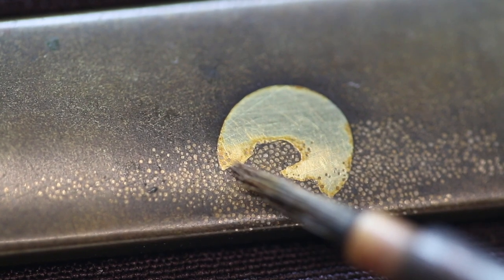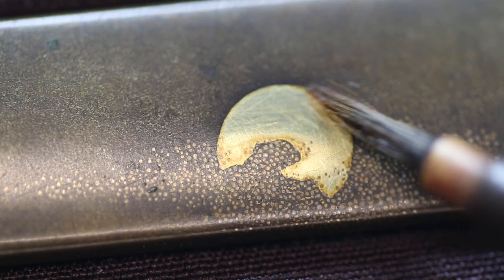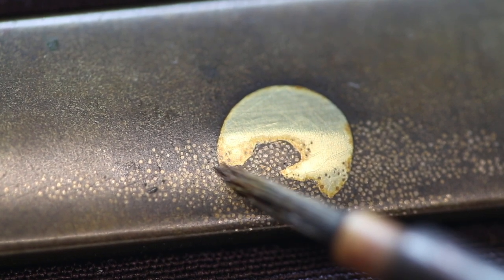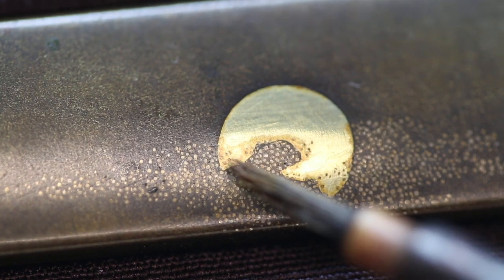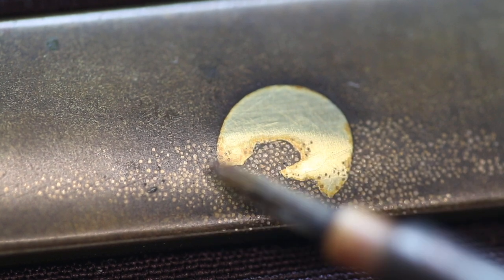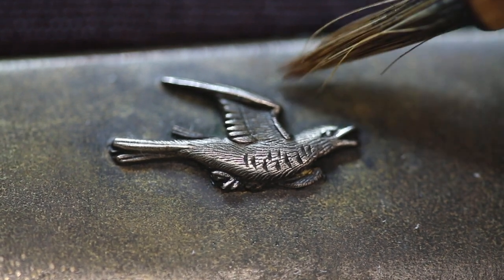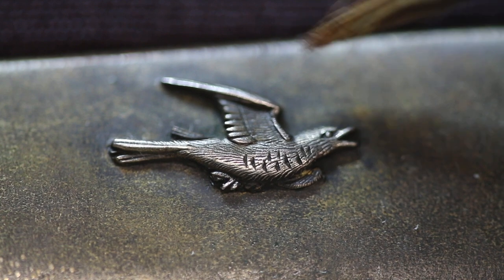There's a little brown staining on the gold. What that most likely is is the silver component of the alloy — it being gold and silver — tarnishing, forming a silver sulphide or a silver chloride, or a mixture of the pair. That then, with the colour of gold and those wavelengths interfering with those oxides, gives us this curious ochre staining. That comes off actually quite readily. This is the other decorative feature on the shibuichi — a tiny nightingale in fine silver. This is probably one of the finest little birds I've seen carved at this scale.